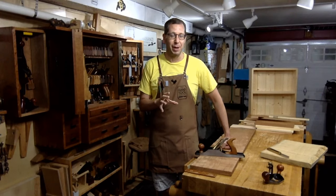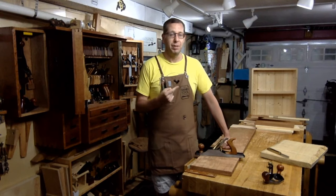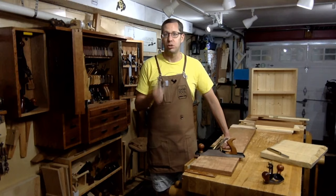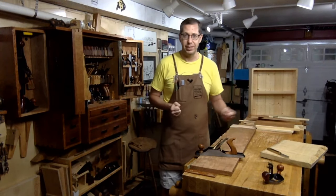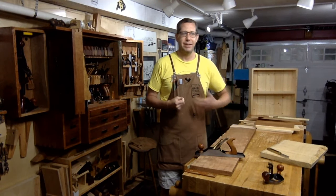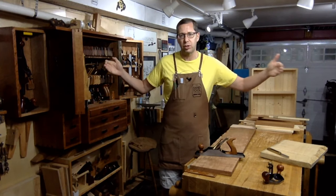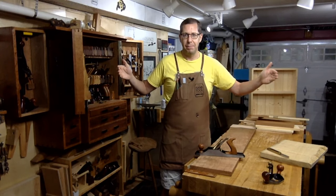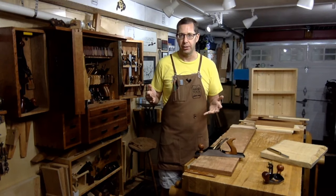So that's the other thing you have to think about. The wood is always moving. I'm in the middle of a thunderstorm right now. The humidity is skyrocketing, and once the thunderstorm moves out of the way, it's gonna drop again dramatically. Any flattening I do right now will be different in 2 hours because of that humidity change. But it doesn't have to be that dramatic. When you're talking about a thousandth of an inch deviation over the course of 24 inches, that is so unbelievably flat that the tiniest little bit of movement in the board is going to change that tolerance.